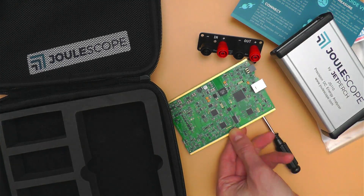Now I should start taking a measurement. So instead of measuring everything, you're just measuring the part you want — like definitely capturing the transmit. In my case with the ABC board, I'm transmitting over cellular, which is going to be a huge amount of current, but I want to make sure I always capture that. So I can just knock that thing high and see that during transmit it's maybe 500 milliamps or an amp for a very short duration while it's talking to a cell tower. The ABC board also has Bluetooth, so I'd want to see when it's in Bluetooth mode or sleep mode as well. There is in and out on this thing, so you can also trigger back in the other direction.